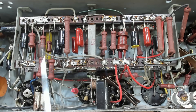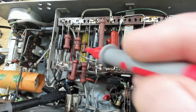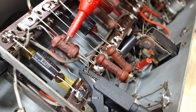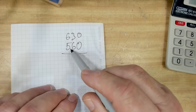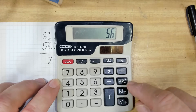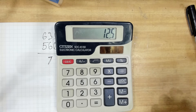I've left the dual main filter cap connected for now — not a lot of hum so I'll leave it temporarily. In the tube there is a bypass electrolytic capacitor; I've secreted a small replacement in there and disconnected one end, leaving it hidden under the wire. When checking resistors as I went, they're all okay — mostly high but not over 20%. The one I was most concerned about reads 1.3M against a 1M3 marking — that's spot on. Another marked M56 reads 632k against a nominal 560k, which is 12.5% rise — I'm happy with that, so no resistors are being replaced.